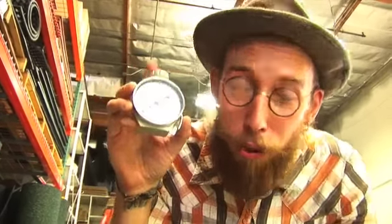The neoprene that we offer here measures 60 on the Shore-A scale, and basically, with any durometer, you always have a tolerance of plus or minus five. This here is a durometer. Let's check out the hardness of our neoprene.